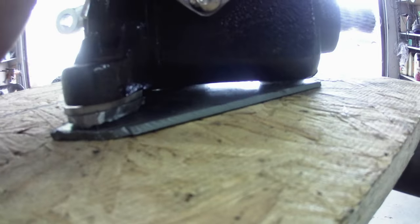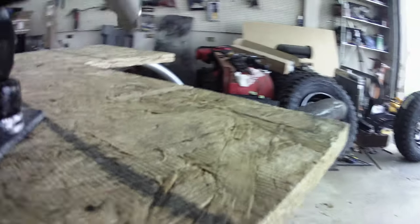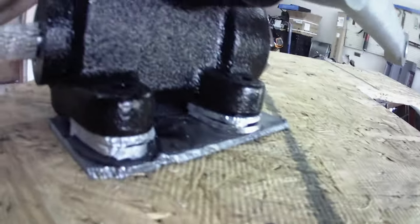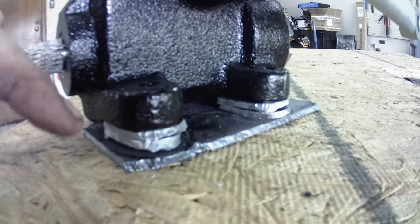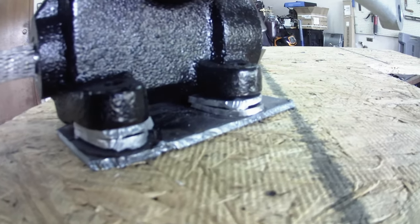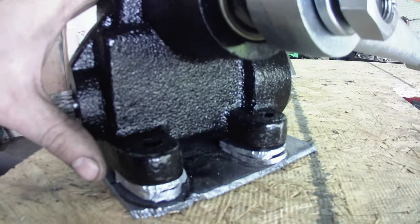And so basically what that does is gives me room. You can see there, camera's all crooked. You can see underneath it, the light underneath it right there. That's what those plates are for, and I think one fell out. Oh, maybe not. Come on, camera. Anyway, two per side. So basically I'm going to weld all of those on, and I might need three on that corner. I'll just dimple it a little bit. Anyway, I'll weld all those on, and then drill straight through it.